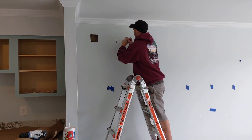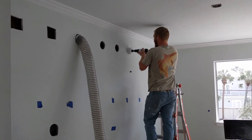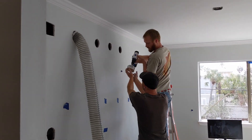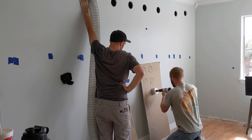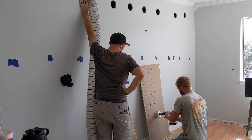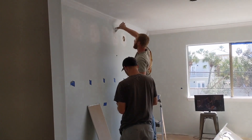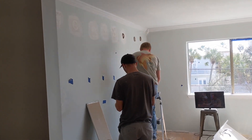For these patches, they started off with a square hole and then ran out and got a 3-inch drill to cut the cores out of the walls. On a new piece of drywall, they cut out squares, drilled out the core, peeled back the paper, and then did a California patch. Looks like they got the process down pretty good, and as they were filling them they were patching them. Today they'll come back and sand it down and texture it.